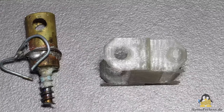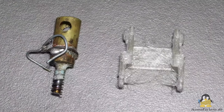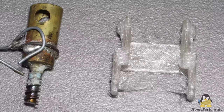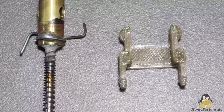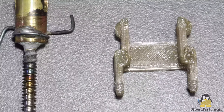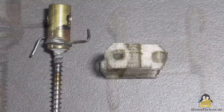It turned out to be problematic that a small immersion depth, hence a short screw design, leads to nicely uniform extrusion, but the side effect is excessive stringing. This disappears if the screw is made longer, but then the print quality visibly decreases. The problem is the lack of precision with the handmade extruder.